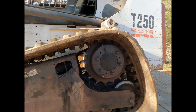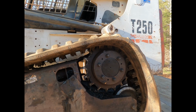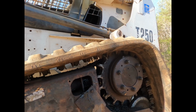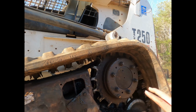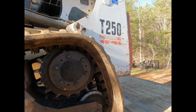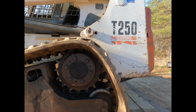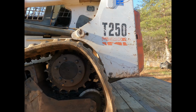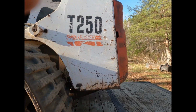So this is the drive motor on the left side that has been giving me all the problems and the fits. Like we said, it made it about 25 yards and then internally it just started leaking. So chances are it's one of these outputs. I don't know. We're going to pull it off sometime and go over it. A place in Texas called Texas Final Drive basically says that if I put both of them on a pallet and ship them down there, he'll give me core credit on them.